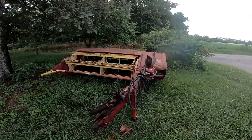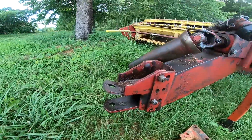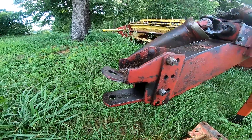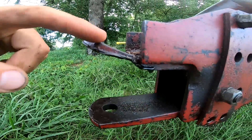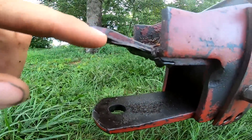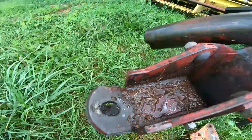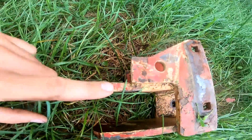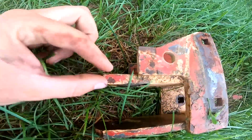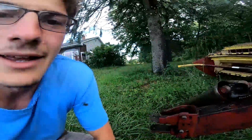We've got some mid-season maintenance we need to do on the mower. This is a big one. Let's look close — we've got to start at the very front of the machine. Very important: we've got to keep it attached to the tractor. So let's look at the hitch. That's not straight. That looks kind of worn — look at that hole. That's a little ovaled out. Now let's compare to our less-abused hitch. The top there looks straight — a lot more material compared to that. So this poor mower has been dragged across the countryside, I guess.